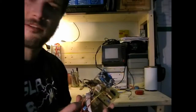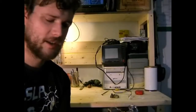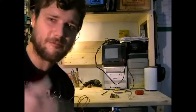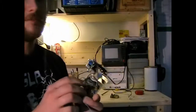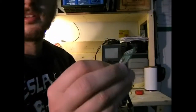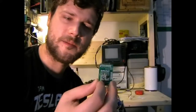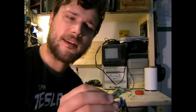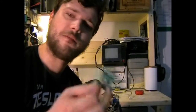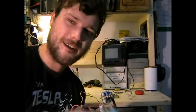We also have been reading analog values. In the end, this board didn't work. It was just not enough time to do everything right, and I just hacked, piled on library after library and stuff. And we only got around 50 data sets or something. And I made a terrible software mistake with the RFM chip. There are two inputs for the antenna, antenna in and antenna out, and either one of those is tied to a GPIO pin, which can be put to high impedance mode